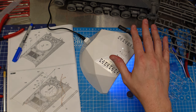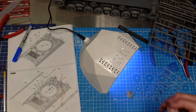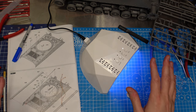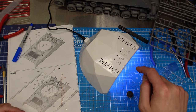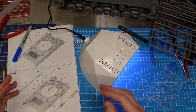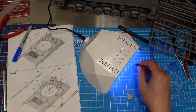It's rock hard. When you add colors, especially darker shades like reds and violets, it takes longer. Yellows cure faster, oranges too if you're not doing too much orange, but you get it. The darker the color, the longer it takes the UV light to cure the resin, because the light takes longer to penetrate down. It just takes longer with colors in it. That's all. But yeah, it works a treat.